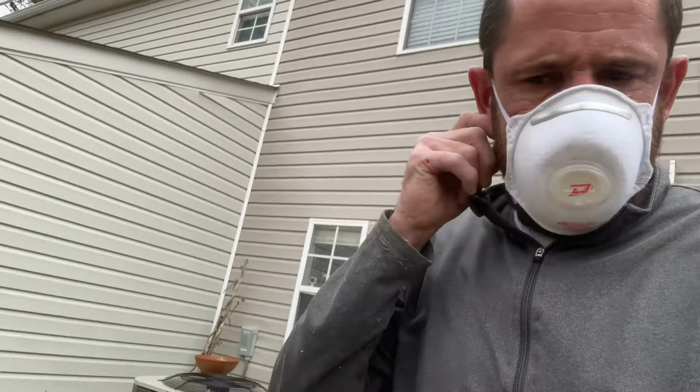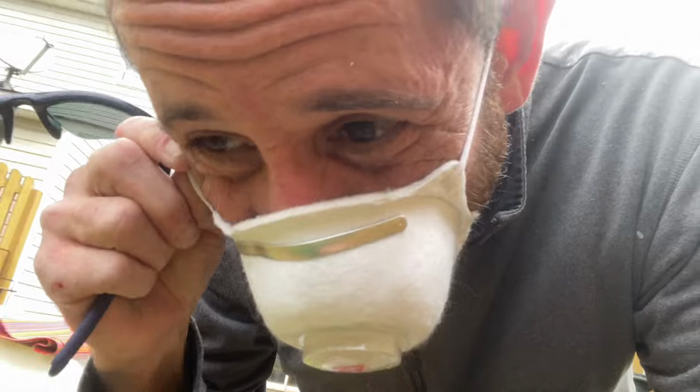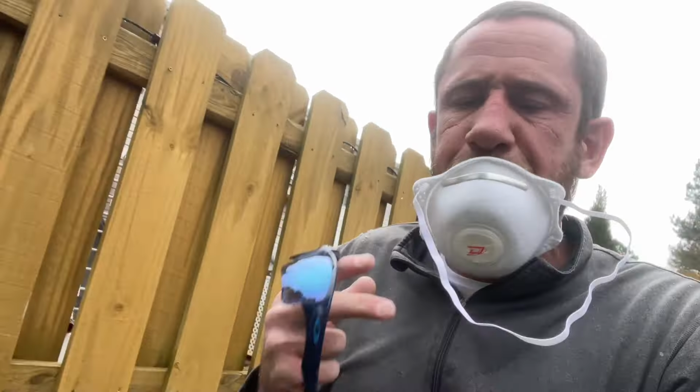All right, now I can't get this stupid mask off. All right, so on the inside, I've already taken a little video. I don't know where I'm gonna put it in, but the flex hose inside is just completely smashed. They have 6 to 8 feet worth of flex hose pushed back behind a dryer. You can't do that, and it's pushed back too far. When you do, it crimps the flex.